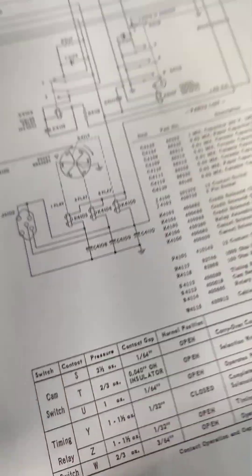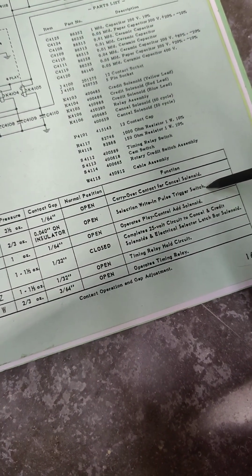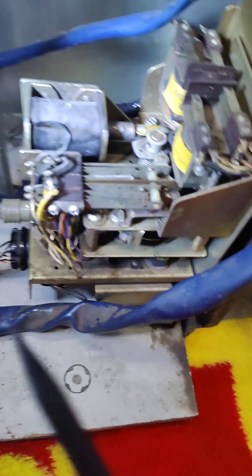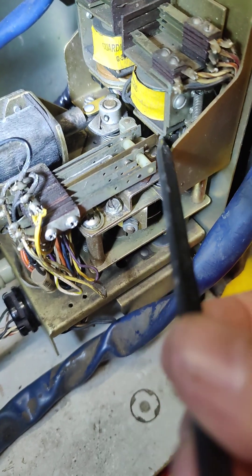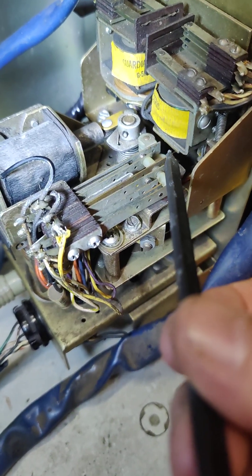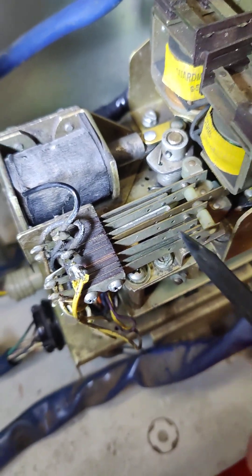Contact T, as you'll note in the service manual, is responsible for the selection write-in pulse trigger switch. Once I had pulled the switch stack, I loosened it and backed it out, cleaned the contact and the insulator pad, and then re-biased the end of the leaf switch to make good positive contact with that. Then I made sure I didn't mess up any of the other adjustments.